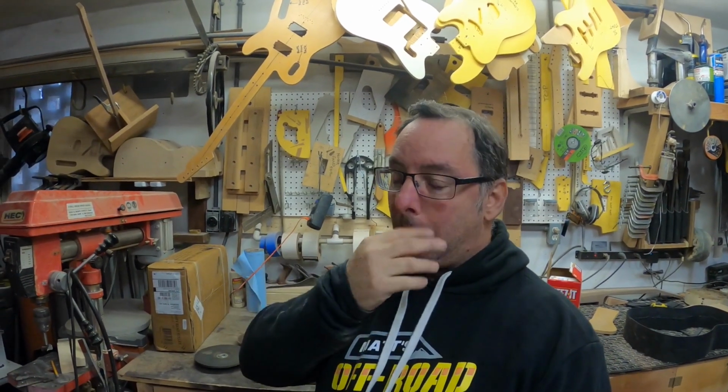I was originally thinking I would just put a bead roll all the way around it, but I don't want that either. I don't mind the bead roll all the way around the edge, but I do want the back to be dished. Can I do that? I have no idea. I've been trying to find videos on how you might do that without hammer forming it, because hammer forming is going to make a pretty gnarly surface to get smooth again. So I don't know if I want to hammer form it. I guess I'm just going to try and press a dish into it.